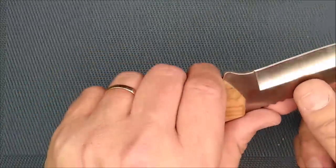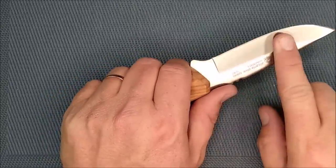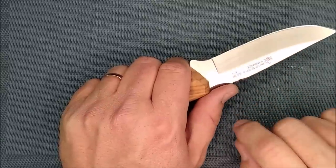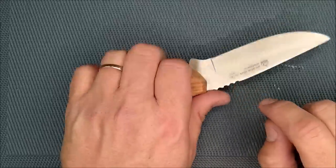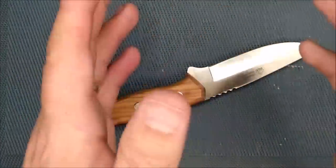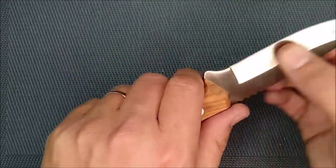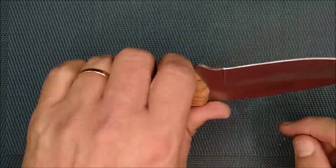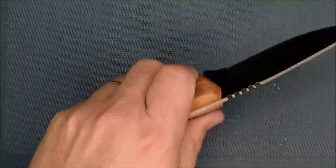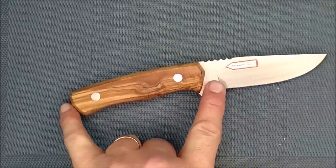When it's tuned up really nice — if I strop this — I bet it would start sliding through paper like nobody's business. If I was to sharpen this up myself I'd probably put it at about 18.5 degrees per side, going halfway between the 19.3 and 17.1 — or maybe all the way up to 20 degrees like a lot of knives of this type.